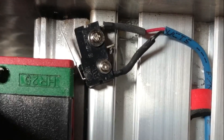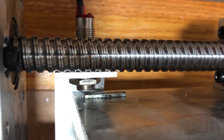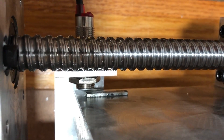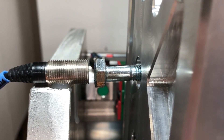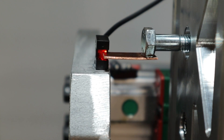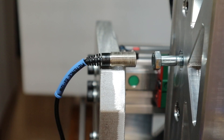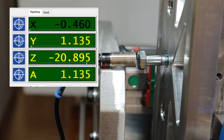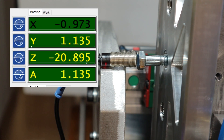I mounted every single switch onto an axis on my machine. I first wanted to build a fixture for this but then realized it already has all of the same components an axis would have. So I homed the axis — and important to note — I didn't use an external measurement. I just drove the axis to home, zeroed it, and then measured the variation to the next home.